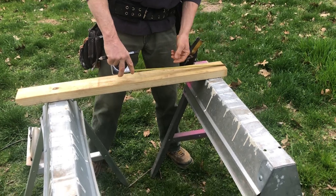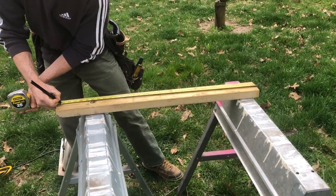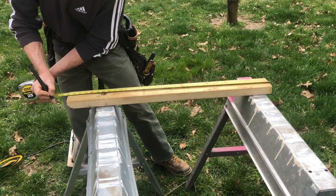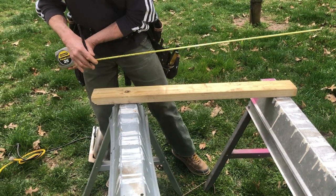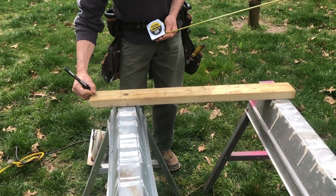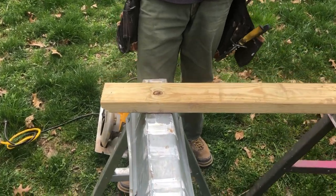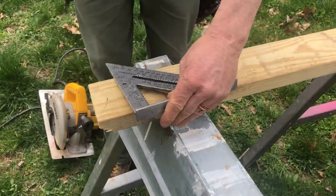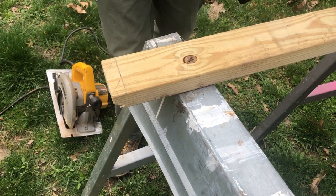We're going to hook our tape measure and measure down 35 inches and place a mark. This is framing lumber so we can put a nice mark — a crow's foot — aiming just for the tip of the pencil mark. Then we take our speed square and square across with our carpenter's pencil, making a nice bold mark on our 2x4.